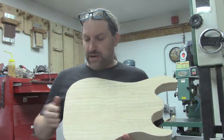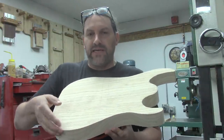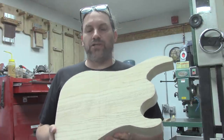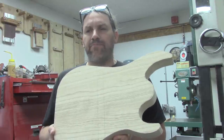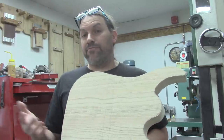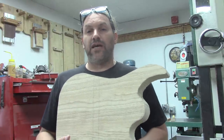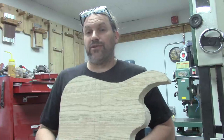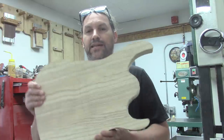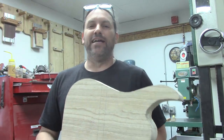This is a one-off thing, so I'm just going to sand this until it feels like it's supposed to be. What I mean is I don't want to feel any weird bumps — I want everything to be smooth. When you run your hand around here, I want it to be a curve, not like ten miles of bad road. I'm going to start out with my small sander that I got from Grizzly because this is kind of the old-school way. If you don't have an edge sander but you have a band saw and some spindle sanders — even from Grizzly or Home Depot — they work really, really well. Let's go over and work on that now and you'll see the transformation happen before your eyes.